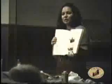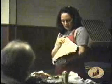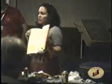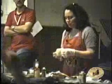Then you talk about loading the pad too much or too little, and then the motion you work in. This is really what takes so much skill to build up. It takes years to master French polishing. I'm not a master. But what's most important is the size of your palm. It has to be very comfortable in your palm.